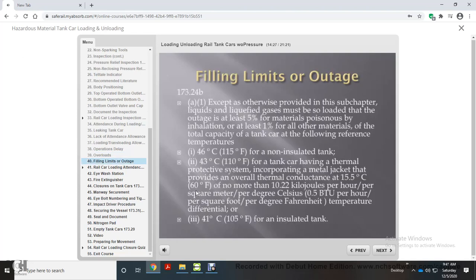In compliance with DOT Regulation 173.24B, except as otherwise provided in this subchapter, liquids and liquefied gases must be so loaded that the outage is at least 5% for materials poisonous by inhalation or at least 1% for all other materials of the total capacity of a tank car at the following reference temperatures: 46 degrees Celsius or 115 degrees Fahrenheit for a non-insulated tank,